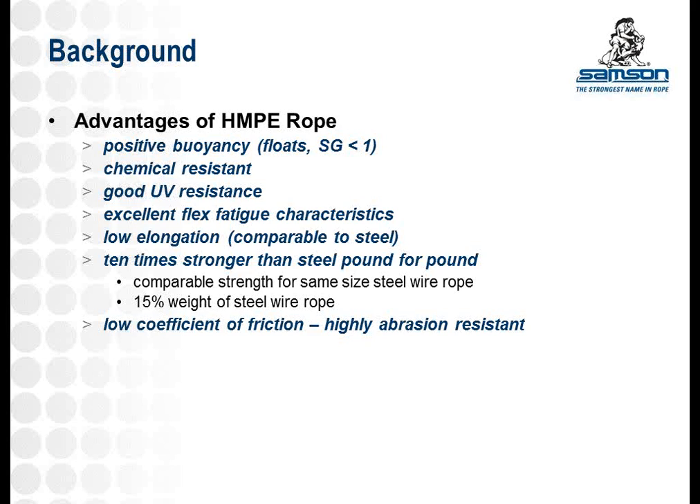The way the polyethylene is actually made, you take these long chemical chains and align them so that all of the strength is in one direction, providing very high strength for low weight, compared to steel, which has strength in all directions due to its high isotropic properties. One of the issues this can bring up is that, as opposed to steel which is strong in all directions, the synthetic fiber is susceptible to wear.